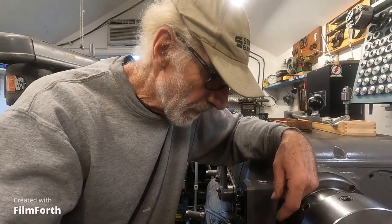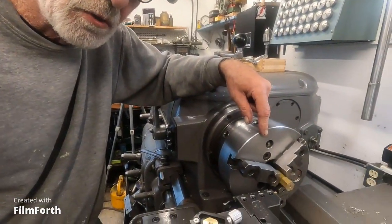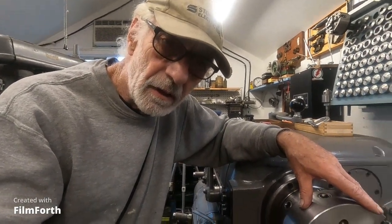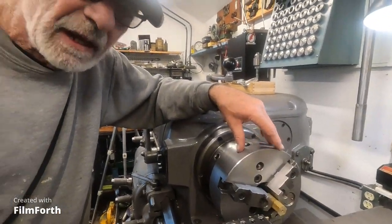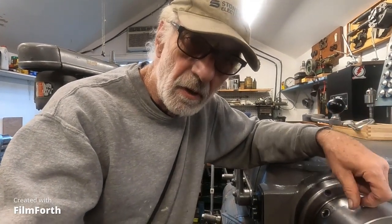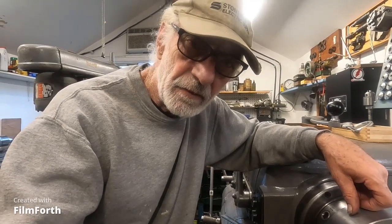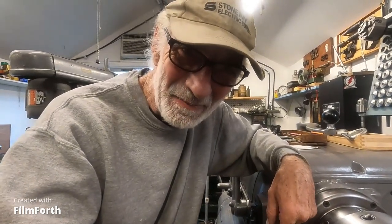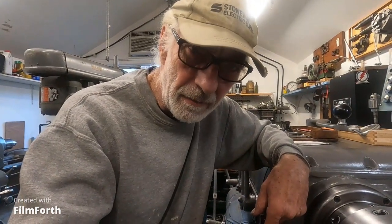1/1000th taper in 2.5 inches. And this one here was showing up to 2/1000ths. So I go, I got to do something. So I got this one here at 1.5 thousandths, and I want to get the 5C collet chuck back on here because it was like over 1.5 thousandths, and see if I can improve that and talk about 5C collets in my opinion and experience. Okay. I'll be back with something else, I'm sure.